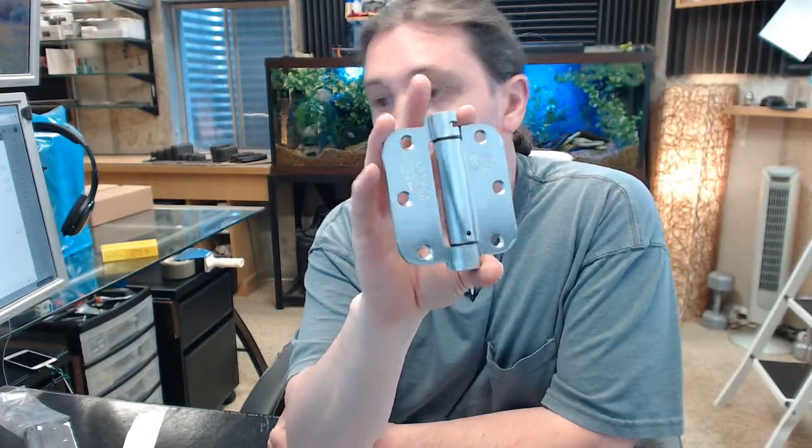Tension collar goes up. It can go pointed down too. You're just going to rotate it counterclockwise. But it's non-handed. You can install this on either left hand or on right hand doors. The situation is the same. After you obviously get the hinge attached to the door hung, you would then set your tension. Be gingerly, maybe go 1 or 2 holes at the beginning at the most, and just test your operation.